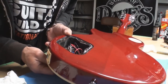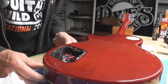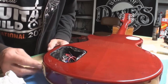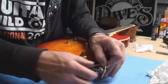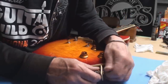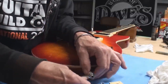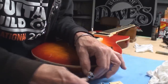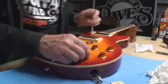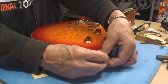That one's wiggling around, that one's wiggling around — they're all wiggling around, so we have to pop all the knobs off. There's no locking washer on the back. The way they try to achieve this is they put opposing nuts — one on front, one on back — which never works. So we'll get that fixed up and get the knobs off.